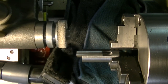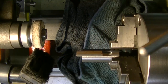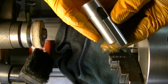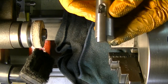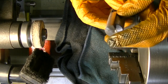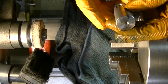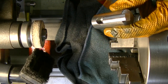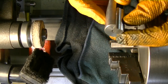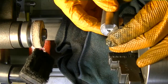Let's see what that looks like. It doesn't look too bad, it feels a bit warm, but I think this is it. I can't tell what you can see there, but to me this is looking pretty good — I got a nice sharp edge right here, it should have the radius. So time to heat this up, pop it off, and then it needs to go to the mill to mill out the side so I can get a quarter-inch broach out of that.